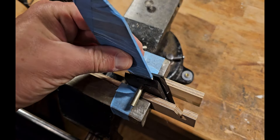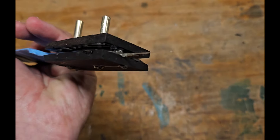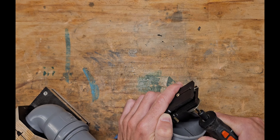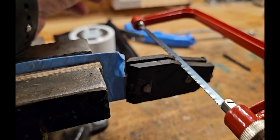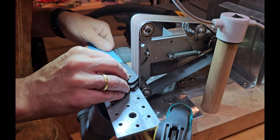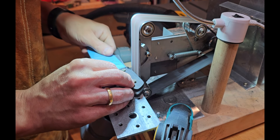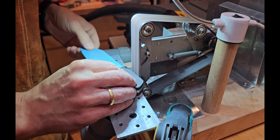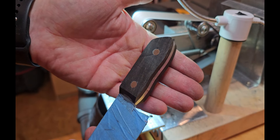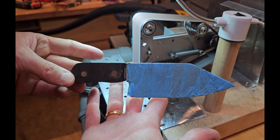Once that's done, you've got a package of glue, wood, and steel that doesn't look very nice. But this part of knife making is the most fun, at least to me. First cutting off the excess pins — I ended up using a regular metal saw. Then roughly cutting the wood down and grinding the handle shape. Wood goes away quite fast on this grinder. When going over the pins, making sure the glue doesn't get too hot and burn, losing its functionality. After a relatively rough grind, transitioning into hand sanding again using the belt.